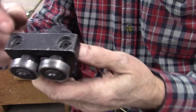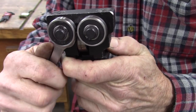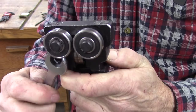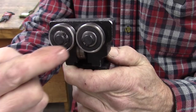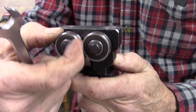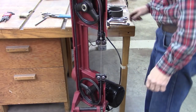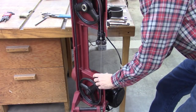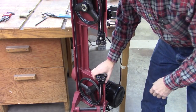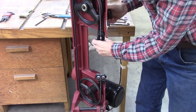These wheels here — these pins on the top have a lock nut. After you loosen them, that's controlling that gap right there. They're both adjustable, so to some degree you can affect the position of the blade, but mostly it's just to adjust the tension against that blade. I've got both blade guides back in there. The bottom one is on a bolt and is usually left in one position. This one is adjustable depending on the width of your stock, but for now we want it in the retracted position.